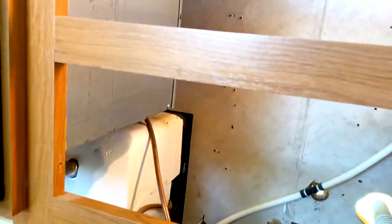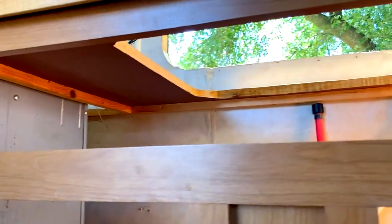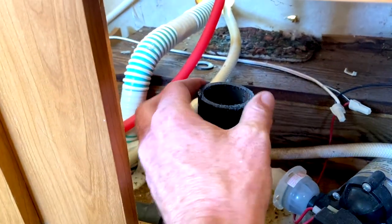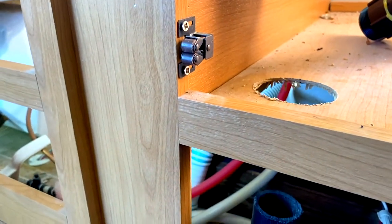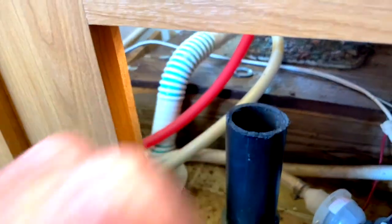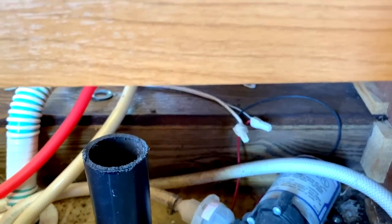Making a little progress — I've got all of the cabinet drawer slides out. As I mentioned, I got the sink out and I've unscrewed and removed quite a few of the fasteners. I know there's going to be some more. I went ahead and just cut off this drain line with a hacksaw so I can get it out of here since it's all glued together — it's schedule 40. I'm just going to buy a coupler and put it back together down here when I put everything back. It was just completely rotten under here — what a disaster — so we are going to keep moving on.